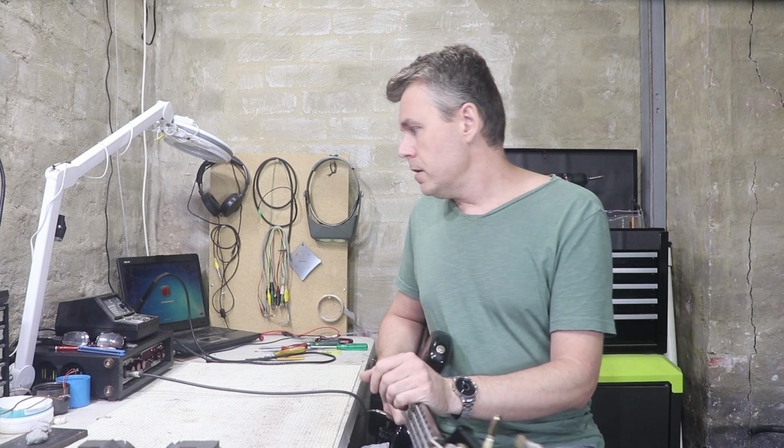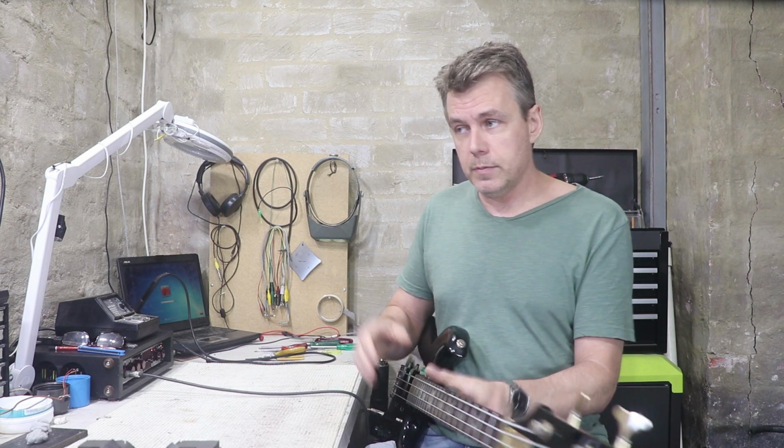I guess if you do have one of these instruments and the pickups are not working, hopefully the video has given you some hope that they can be repaired or at least rewound. It's not easy, but it can be done. I think we got really lucky though. These pickups, as you saw, were wrapped from the factory before they were potted in epoxy. Without that wrapping, the resin just sort of soaks into all the windings, and there's no way you'll get the coils out intact. You can certainly get the bobbins out though for rewinding. But yeah, I think we got lucky there and only had to, as I mentioned, rewind the 1 out of 4 coils. So there you go.